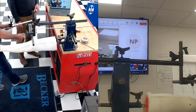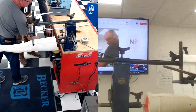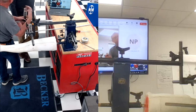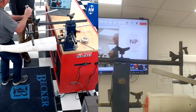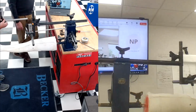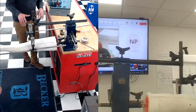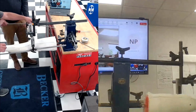One of the next tricks that you can do is if you have a marker. Once we set it where we want it and we align it onto the mold, I just make an identifying mark across the joint itself with the marker, to tell me that if this joint was to rotate or shift, I've shifted and I just need to return to that area. So you want to give yourself a reference point of how you lock that T-handle onto the holding tool, and then just be mindful as you're bending that if you get that loose or you rotate it at all, you want to be able to return it. All right, you want to touch that one too? We'll do the same thing.